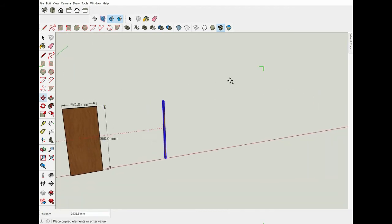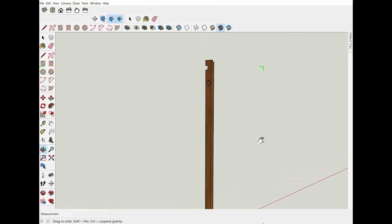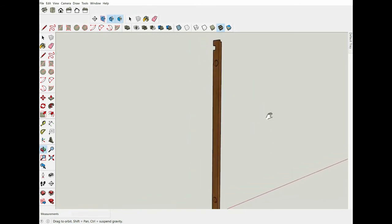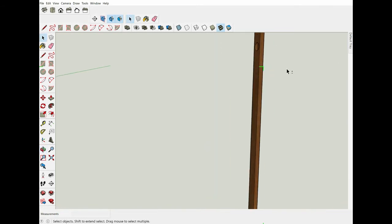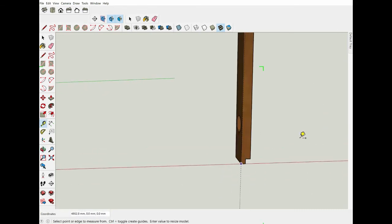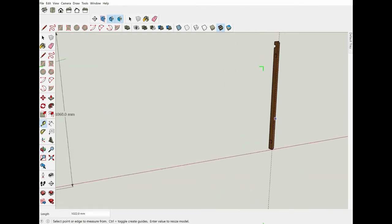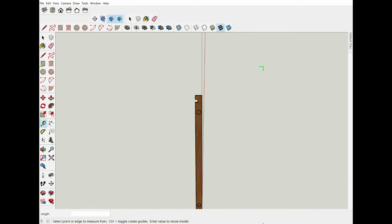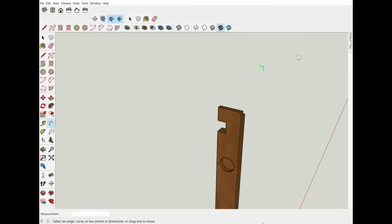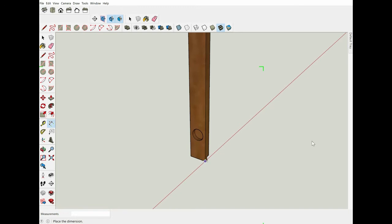So this is the side panel, the vertical upright, I should say, that I have designed for the project. You can see I am dimensioning it. Those holes in the middle there, that is for the hinges. Now I'm using a Richelieu hinge. It's based off a System 32 for the adjustable shelves. You see this most in IKEA furniture, where you have the small little holes for the adjustable shelves. They are in fact exactly 32 millimeters apart, and that's where the name System 32 comes from.